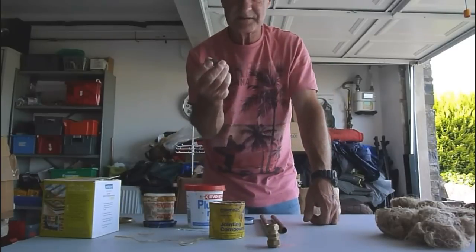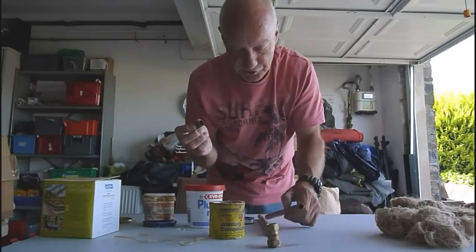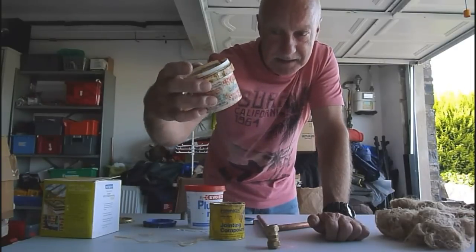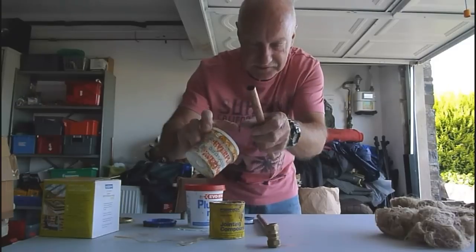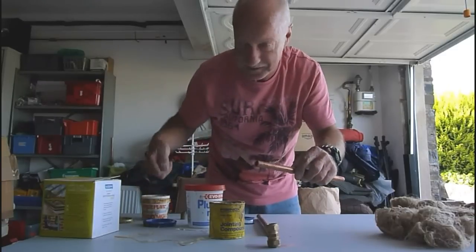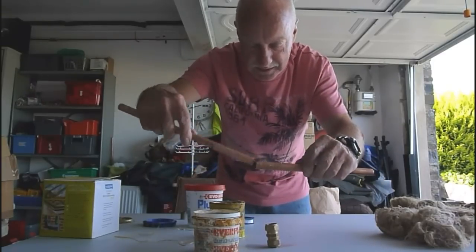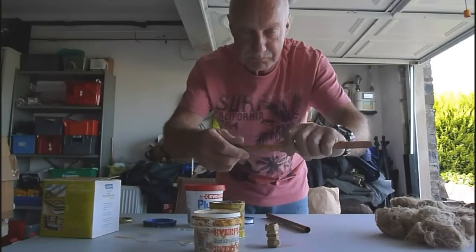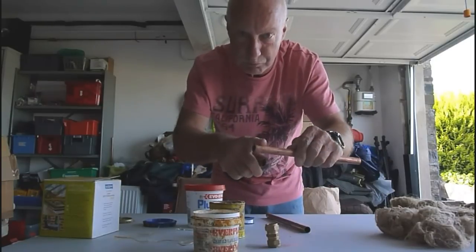Obviously, if you're using solder fittings, it's a different routine. I've just grabbed an old solder fitting out of the box — it's a bit old, just to show you. With this you do need something like this — this is the one I use, Everflux. I don't know if it's still about, but there's lots of take-ons to this one. Don't dip your finger in it and put it on — it will burn your finger; if you've got any little cuts and nicks it makes a hell of a pain. So put it on with something else. I usually use a bit of solder, dip it in the tin and wipe it around the joint like that, then just push your fitting in. Now, if you've got a fairly new pipe and a new fitting, you won't have any problem having to clean it, because this stuff cleans the pipe as you go.